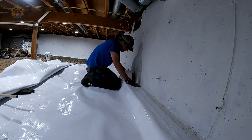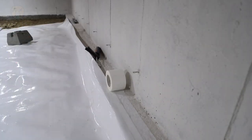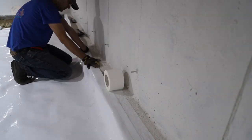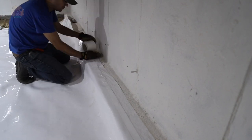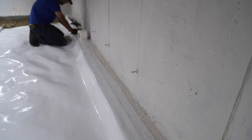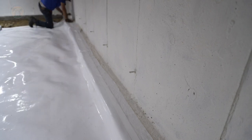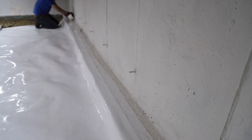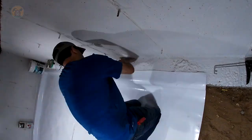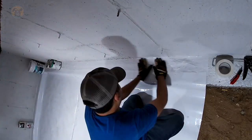Now this tape you see me putting on — I put some Gorilla Glue caulking underneath it, and then I also add the tape. That tape is designed to connect the type of tarps used for flooring, and it's really good at connecting the tarps. However, it's terrible at connecting to brick. So eventually I end up removing that tape and putting down some heavy-duty Gorilla tape. The caulking did a really good job once it hardened and dried — two different layers of protection to make sure it's sealed really well. You can see me really putting on that Gorilla Glue goop, and then I put a bunch of paint buckets down to add weight so it doesn't go anywhere.